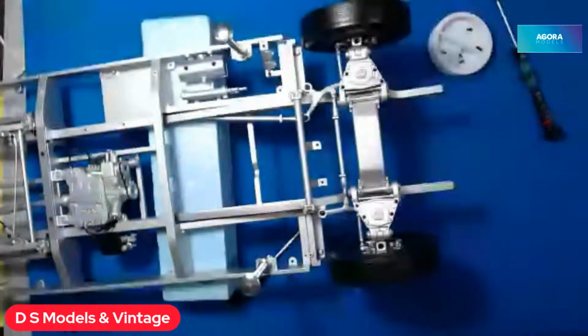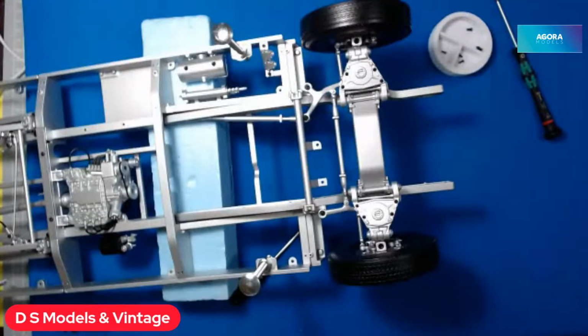we have to fit a part that we did a long time ago. It seems a long time ago, which was 22K and 22N. So take the connector and line assembly from issue 22 in set right. Identify the fixing points on the subframe above. The bracket 22K is fitted with a screw hole in part 27B circled in red. The end of the line 22N is connected to part 23A circled in blue.